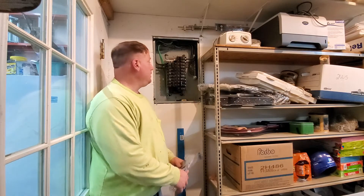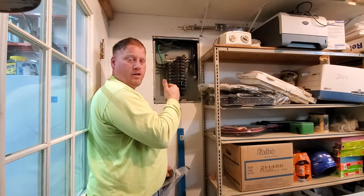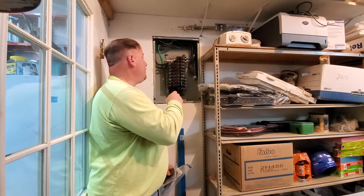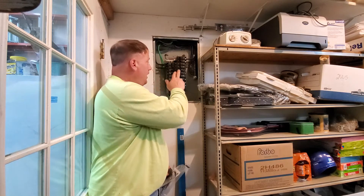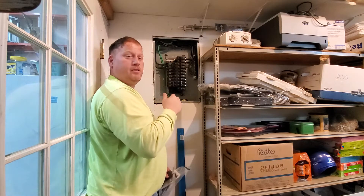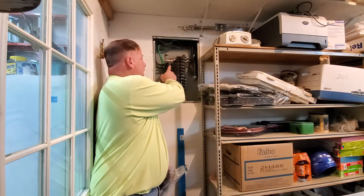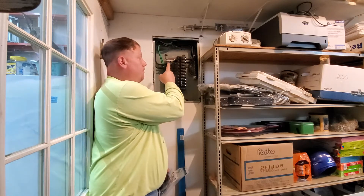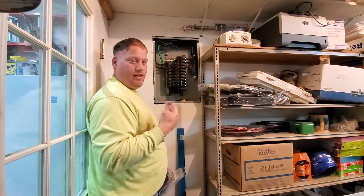So what we've got going on here is we brought in main power from the main panel, taking power out to another sub panel for the RV that you saw in a previous video — I'll show that link up here. I've upgraded this — this was a main panel — and I had to upgrade to a 125 amp because I'm feeding a 100 amp panel out for the RV. This panel now has a disconnect breaker here and also a breaker out there as well, and in the main panel I have a 125 in both spots, so technically I can kill it in both locations.